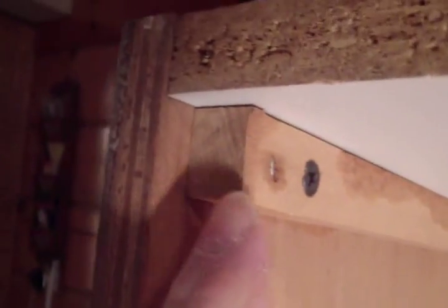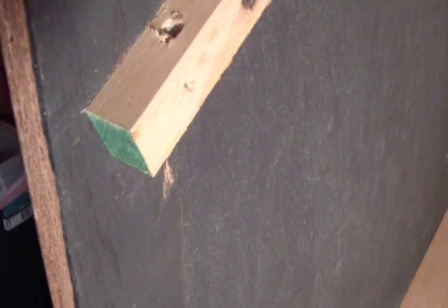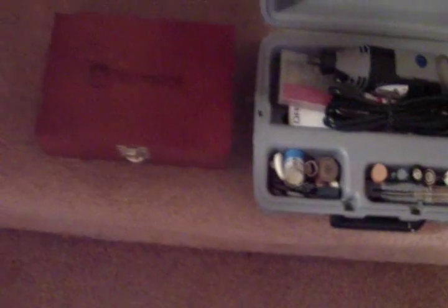We're going to do it up on top. We've got 1/2 inch clearance up here on top. We'll just have to cut these back maybe another 1/4 of an inch because we can butt the cleats up to these. But on these, the full width of the cleat and an extra 1/4 inch have to clear. So we'll probably have to do about 2 inches or so. We're going to do that with the Dremel tool. Got the Dremel tool ready over here. Hasn't hardly had any use. Had this for a few years, but need to break it out and get some cut-off bits and do this. So we'll be back in a few minutes.